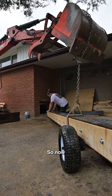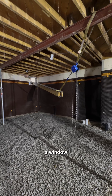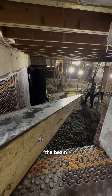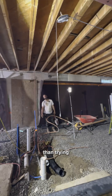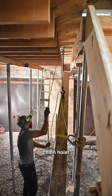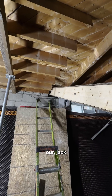Now I have the completed beam on the beam dolly and we're maneuvering it into the house through a window that's open because of the underpinning. Once the beam is in the basement, I move it using a series of chain hoists - much easier than dragging by hand. I sling the chain hoist across the joists, drag the beam through the house, then lift it up into the pocket with jack posts underneath.